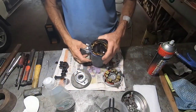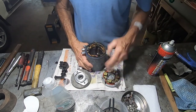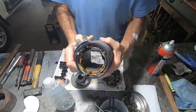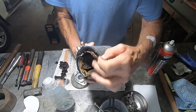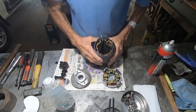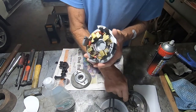I've got a 1200 watt Maxwell anchor winch motor off a friend's boat — it's been playing up for a long time. I'm going to have a look at it and see what I can find out. I've got Terry's anchor winch motor here pulled apart and I've found a few little things that I'm a little bit concerned with. There's been a tiny bit of moisture in there, a bit of verdigris in there, and this is the brush holder.